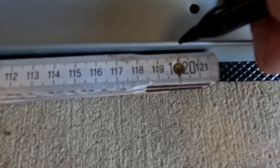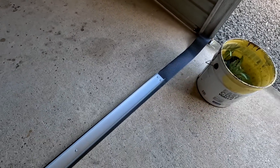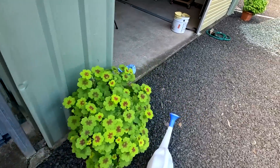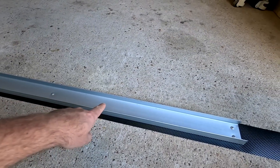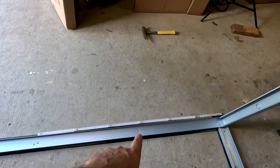Here exactly 600, and then at 1200 that's always the middle of the wall stud. At the end of the track I have another two 50 by 50 galvanized steel posts I want to put in at exactly this location. One goes over here and the other — I don't know if I do 600 or maybe 500 only — because I need the wall in this area to be able to carry a bit more load. It's not for a battery, but you may already have a guess what it could be. The next wall stud will be at 2620.